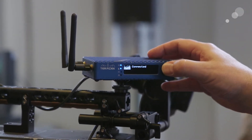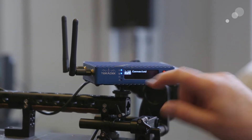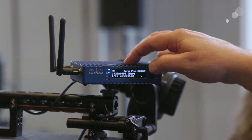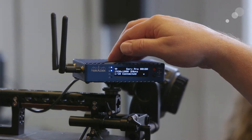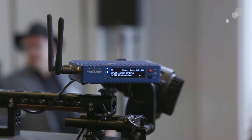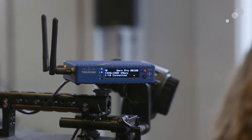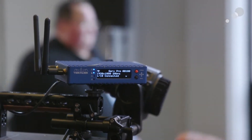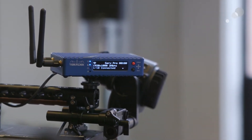You can see from the ServPro, it's a very, very simple interface. I'm connected. I have one iPad connected — it's actually telling me what devices are showing on this. So it can actually see how many devices are connected to this individual device, even though I'm connected to a router. It monitors full time, all the time. I can actually choose between 1920, 1080, or 720 streams. I can even go down to SD if you need to. And the device will dynamically switch quality when you have more and more users on it, reducing the bandwidth to give you a higher concentration of users.